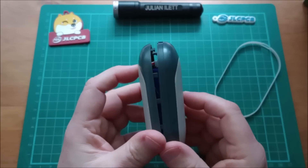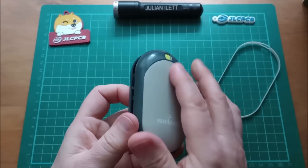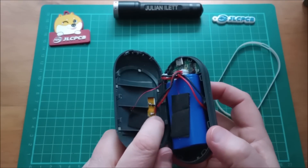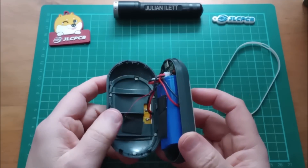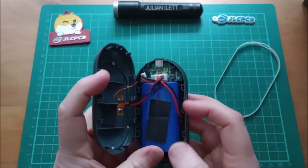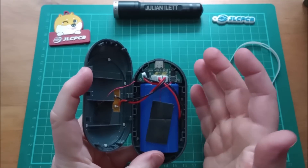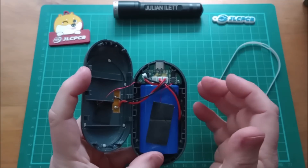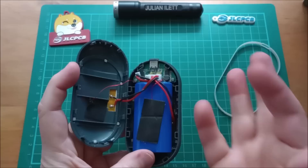What do I mean by it got hot, because surely it's meant to get hot? Yes it is! These side panels, which are actually aluminium I think — they're metal — they have little heating elements, and you can see the heating element there with thick pair of wires going up to the PCB. But it wasn't these two heating sides that were getting hot; it was the printed circuit board. And as well as getting quite warm, it was also starting to smell of burnt electrical stuff — that sort of smell where enamelled copper wire is burning.